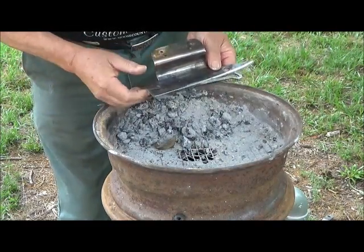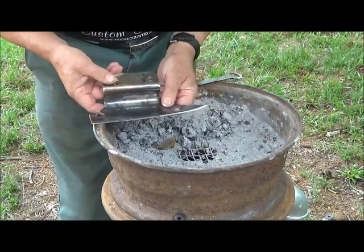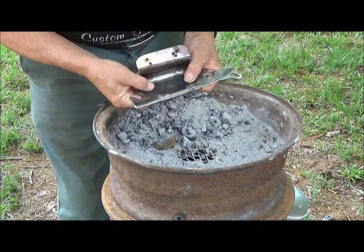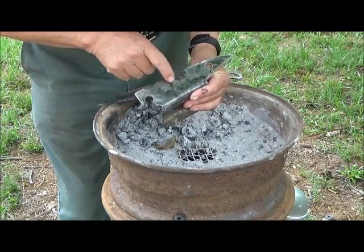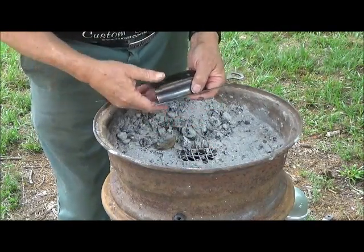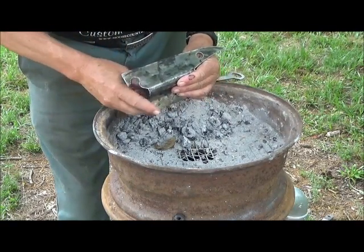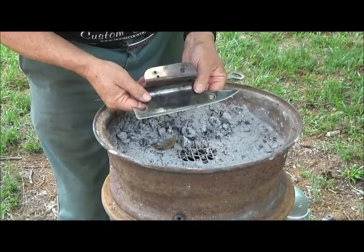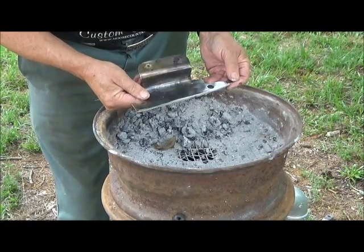On this complex shape, I took more care to move it across the flame more uniformly, and there we still do get some discoloration of the steel. We still get some differential heating right here in the middle, right over this vent where it came up and where it rested the longest. But the tempering did go successfully. So now the blades will have to be put on sanding belts and these superficial imperfections removed, and then we'll be ready to go.